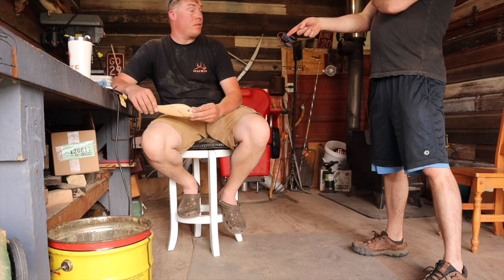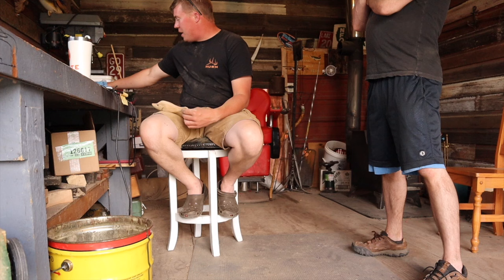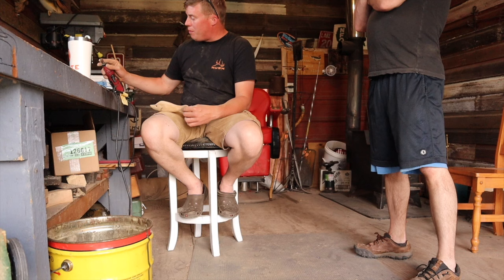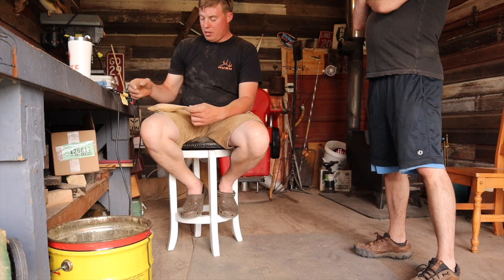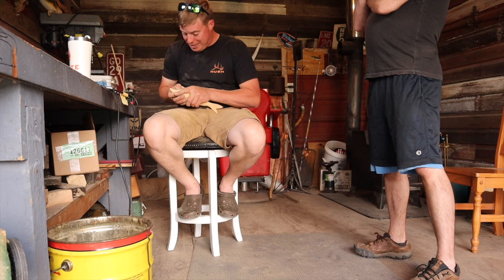What would have saved you time on this? I use a specific thing to undercut the gills. That would have taken less time. I use these sanding drums. I have 5 or 7 of them. You see the grit paper on this is like 60. I have a 60, 120, and 240. I'll back cut this with a 60, then go over it with 120, then 240, and then I have that flap wheel, and then you're done. Then it's just some light hand sanding.